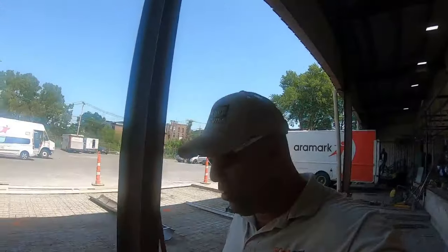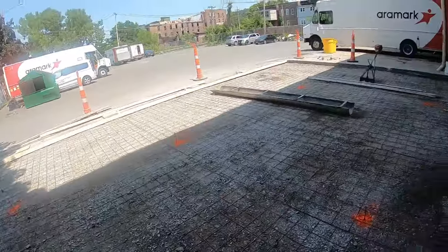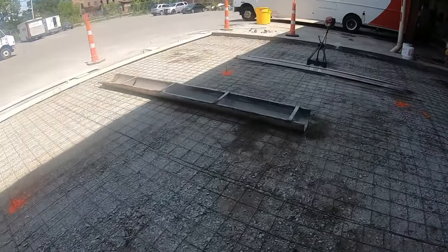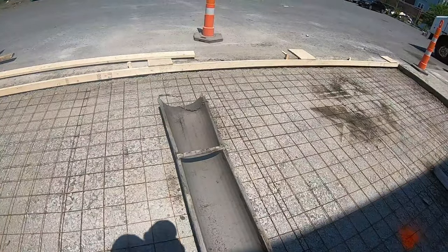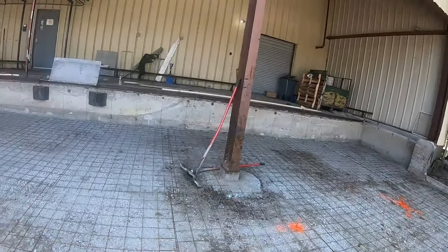Jack, concrete's on the road. It's just about 1:30. Got all our wire grade stakes in, compacted. Tools, chute to reach all the way back here. This is an aluminum chute, 16 footer. We'll hook that right to the truck's chutes with a chain. Then we'll be able to reach and we won't have to pull so much because this is real thick.